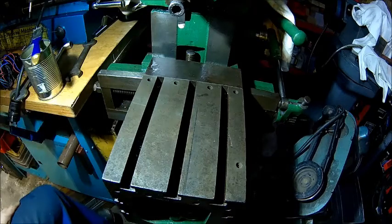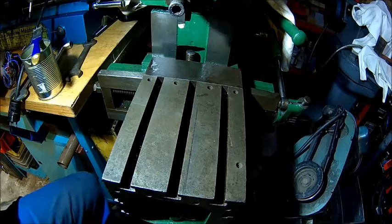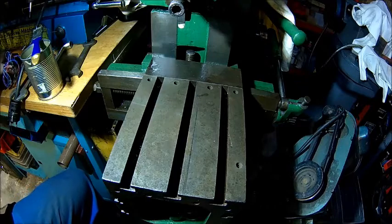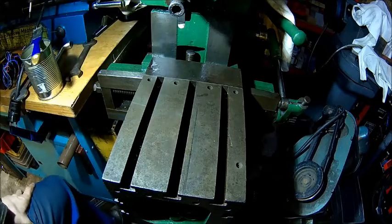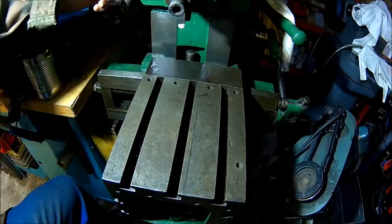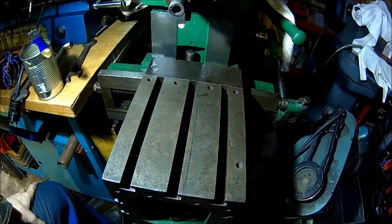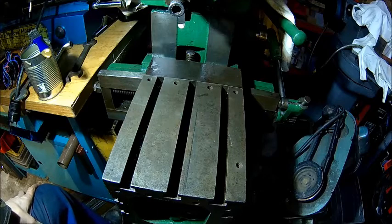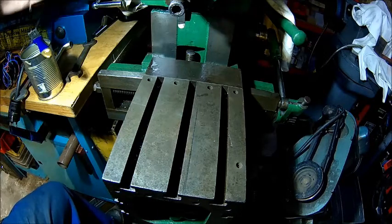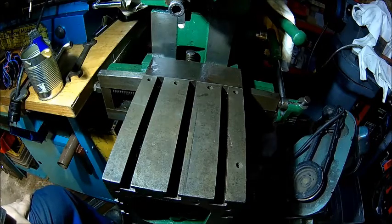You can still crank it by hand. I don't know if anyone has made an attempt to make a CNC shaper, but I just had the idea and I think it's probably a neat project. What I also want to do, because I've fitted an inverter drive, is put some reed switches here which lower the speed on the change of direction, so that the clunking and the wear in the machine would be less. It gives you other opportunities to play with — you can always stop at the rear and things like that.